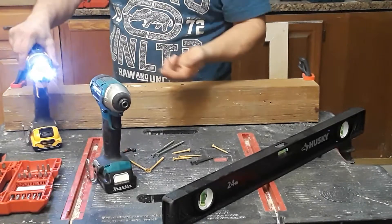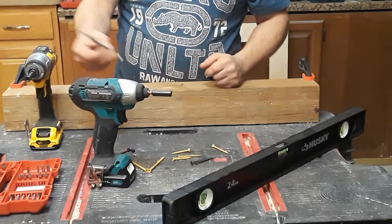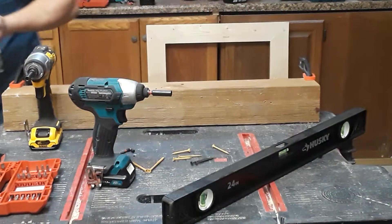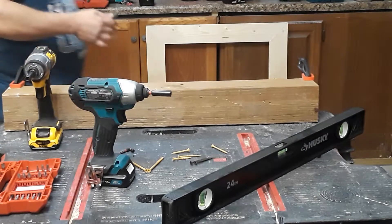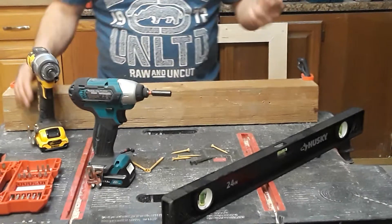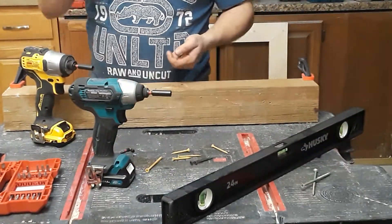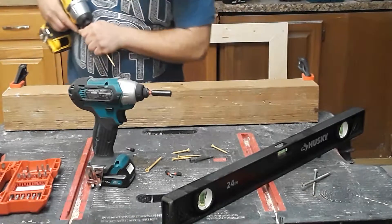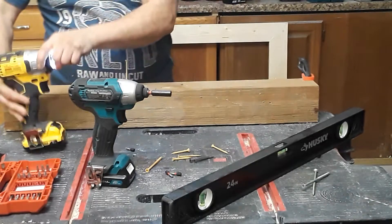You're not really going to use 12-volt tools for heavy-duty screws. If you're going to buy a drill like this to drive large screws all day, you're going to break it, plain and simple. I wouldn't drive anything bigger than a 3-inch screw with a 12-volt drill.